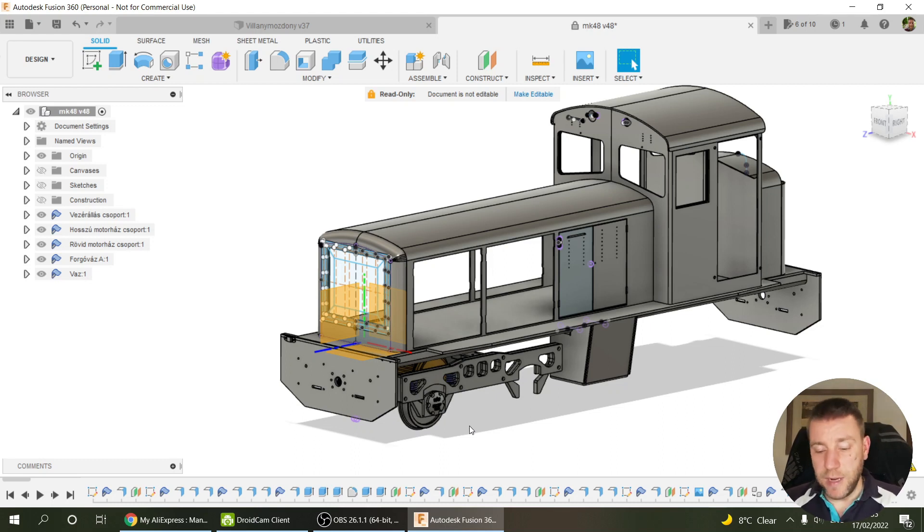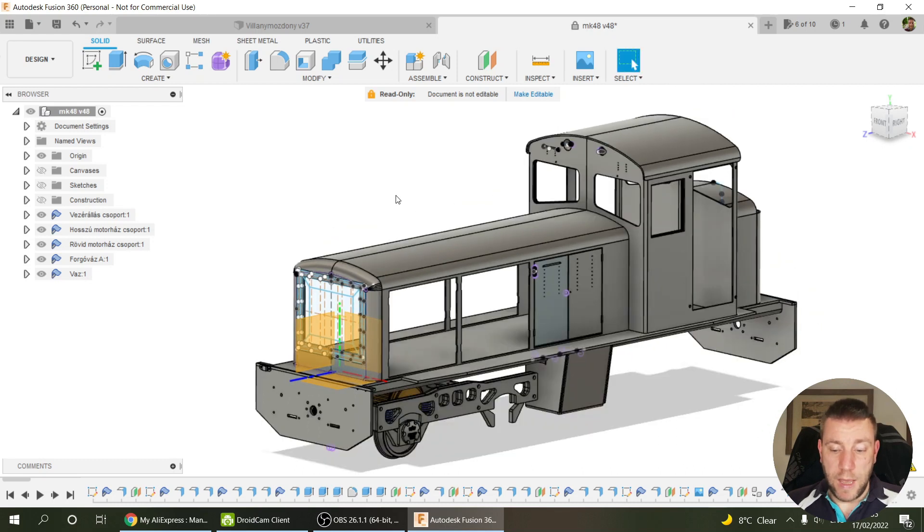On top of that, I was making a lot of compromises with the spring mechanism design. The laser cutting company said they pretty much only have a one millimeter radius on their bending forms, so the roundings on top of the cab — they wouldn't do it. They said they could probably bend it in steps but it wouldn't look good and it would cost a lot of money, which I wouldn't be willing to pay.